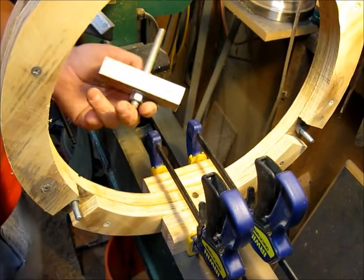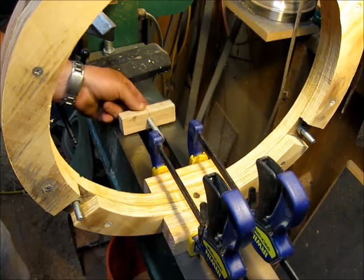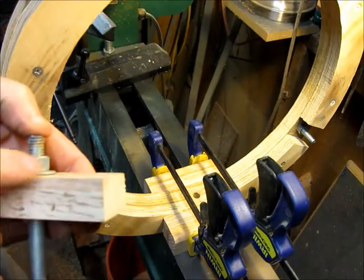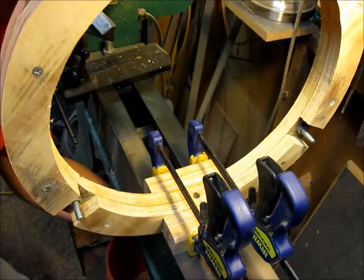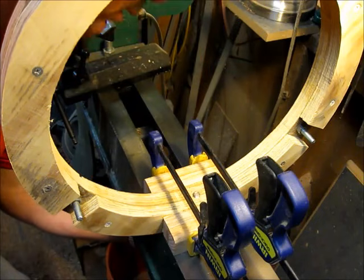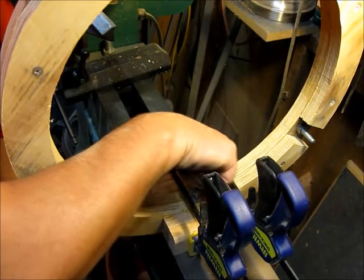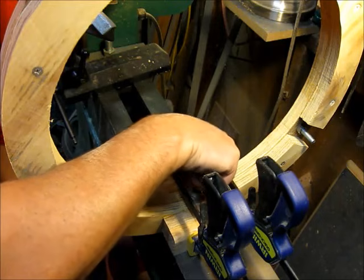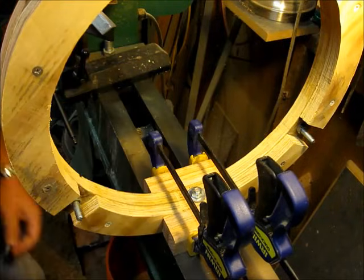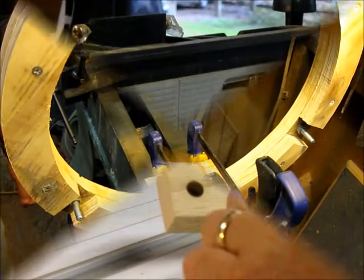Okay, here's my clamp block I made. It's just the width to go up under my lathe bed to clamp up with. So I'll show you how this works. I've got a threaded rod, goes straight through with a nut and all on the bottom. Let me see if I can line it up here. There we go. Washer on the top. A nut. Make sure your clamp block's turned at a right angle to the bed. Okay, that's hand tight. Oh, that's really tight already. I haven't even gotten a wrench on it yet.